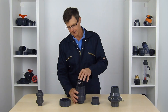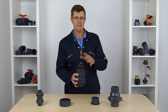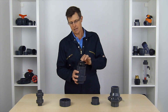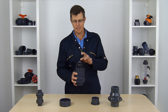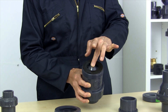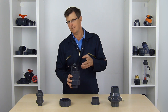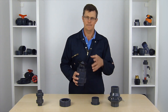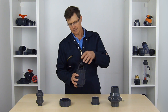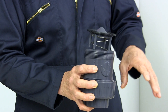There are a couple of things we need to note. First of all, we need a fairly decent head — a metre, metre and a half head minimum — to be able to start pushing that spring down. If we haven't got at least a metre or metre and a half head, we're not going to have enough pressure to push against that spring. The other thing is, if you imagine bits of grass or debris in our water, as it comes down here it's going to get tangled around our spring, and eventually the debris is all going to build up around it, and that's going to block and we're going to have to service it and take it out.